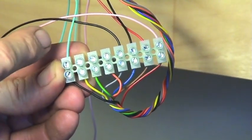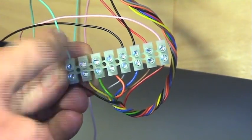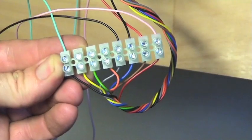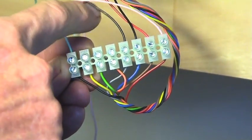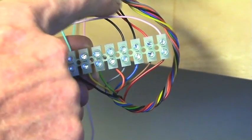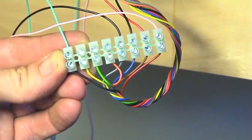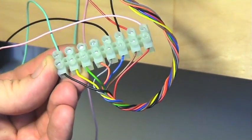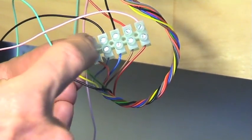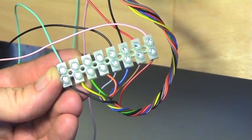Okay, so we've got our electrical connection for our drive here and here, which is 1 and 8, or red and black. Then we've got obviously our frog common going to the frog, and our 2 rail polarities here. Make sure you get the right one so it matches up when the switch switches that the frog polarity is correct. And that's about it. You've still got another 3 contacts here for switching a signal or something like that.